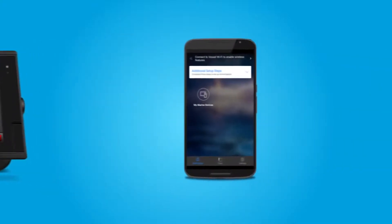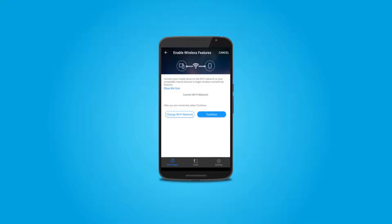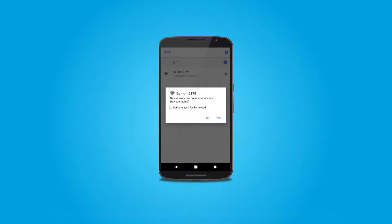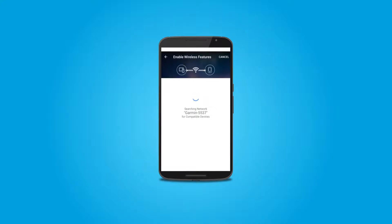Now, in the ActiveCaptain app on your mobile device, select Connect to Vessel Wi-Fi at the top of the screen. Select Yes, since you configured and turned on your Wi-Fi in an earlier step. Next, go into your Wi-Fi settings in your mobile device. Select the Wi-Fi network for your marine device and enter the password when prompted. If you have an Android mobile device, a screen may appear indicating the marine device's Wi-Fi does not enable internet connectivity. Select the prompt. Another screen will appear repeating that this network has no internet access. Select the checkbox and then Yes. You must do this for the app to function properly. The Connect to Chart Plotters screen will appear again and this time select Continue. At this point, the app will connect to the Wi-Fi network for your marine device. This screen may show for several seconds.